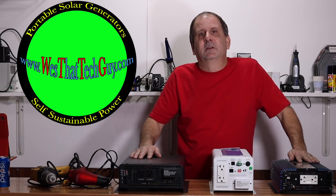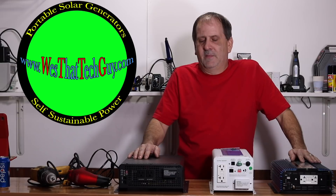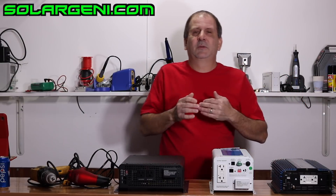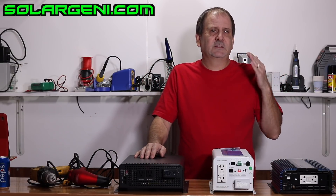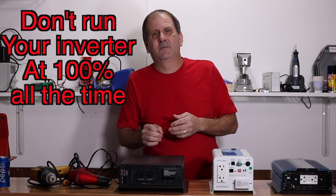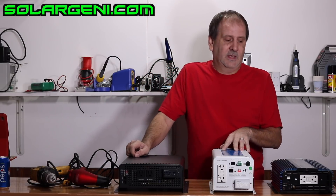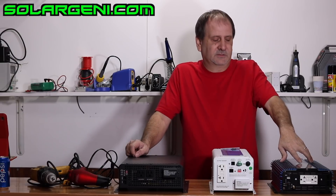In closing, the best thing is to decide what your power needs are, what loads you'll be running, and that determines your inverter choice. Don't size your inverter exactly to your load — if you've got a 2,000-watt load running all the time, get a 4,000-watt inverter, because you don't want to run your inverter at 100% load continuously. For daily use, go with a low-frequency inverter; for occasional use in an RV or tailgating without inductive loads, a high-frequency inverter is fine.